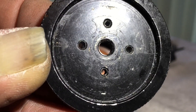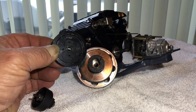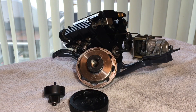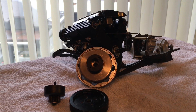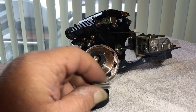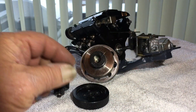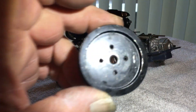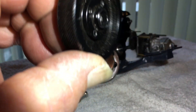Here's what I did — I took the flywheel off just the way it was and I got a little bolt here, a 6 millimeter bolt. Let's see if I got one laying here in my pile of stuff. Take a 6 millimeter bolt — you see it there.